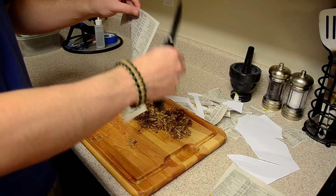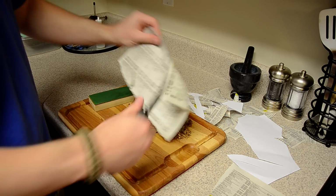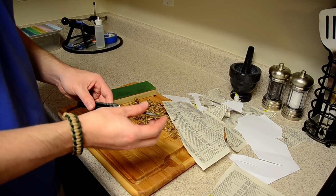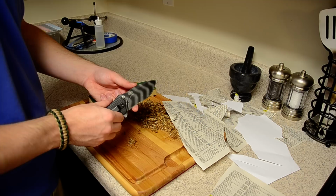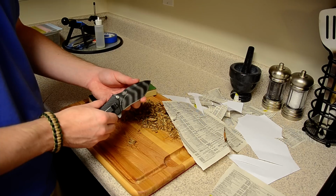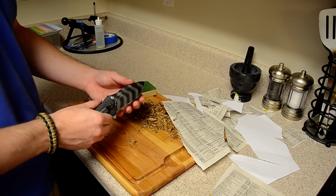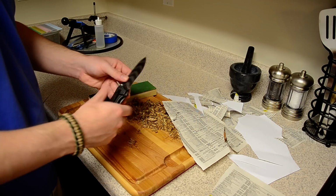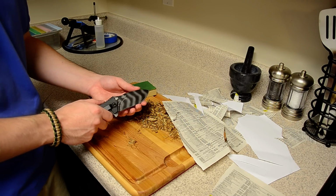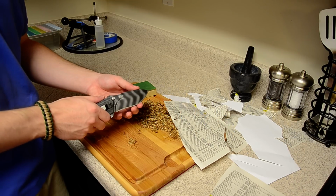It didn't help much, if any. It's going into that toothy working edge. It's sharp right here, where it didn't do much cutting, and it's sharp right here. But right here, it would still cut me if I really pushed into it, but it's developed into a toothy edge right here. This edge would continue to cut for days and days and days. This is still sharp enough to cut most anything, but if you're trying to shave hair, then it's not going to do it.